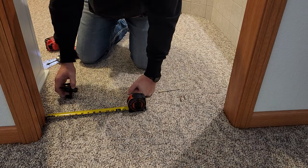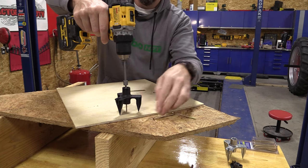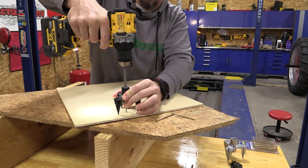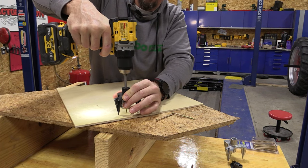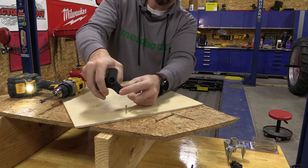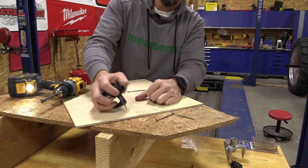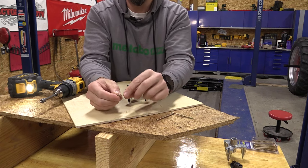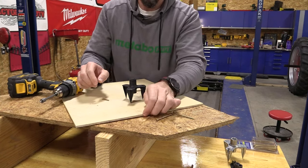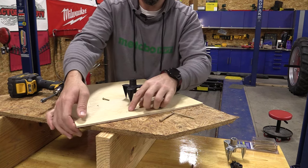I'm going to show you here on the jig so you can see more of what's happening. We're using this like we would on linoleum — we have some wood that's moving around here. We'll just use this jig, go in, we don't have to go fast, just push down slightly, making sure the jig is pushed down like it was on carpet. Get to the bottom where we can't screw anymore, then pull this off. There's a place in one of the legs where you grab the head of the screw, then just rock it — and that will pull out. If you're pulling that out in carpet, there's a little ledge, so be careful not to grab any carpet when you pull. Here we are sitting below the surface.